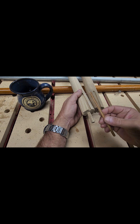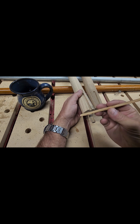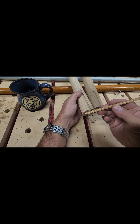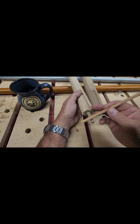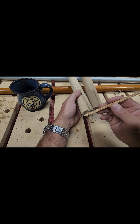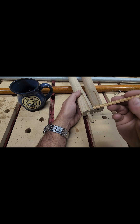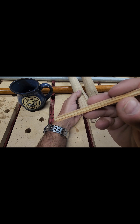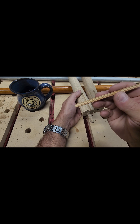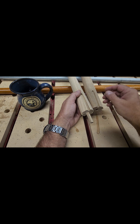This spline is made out of a sandwich — on the top and the bottom is mahogany, and in the middle is this same white oak material. I'm hoping that when we finish it, the white oak in the middle will essentially disappear into the rest of the piece, and you'll see the two little strips of mahogany that come to a nice curve on the end on the outside.